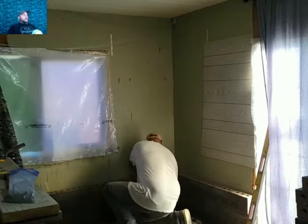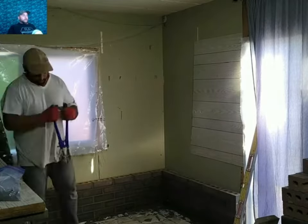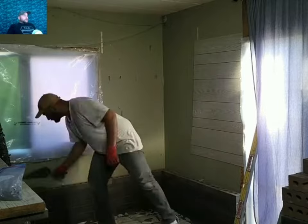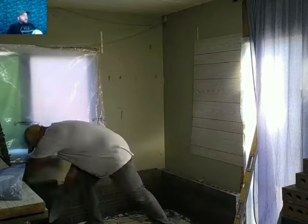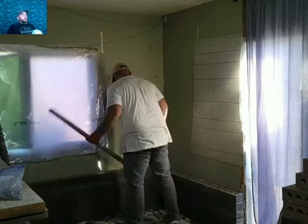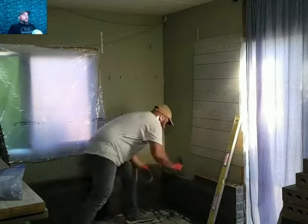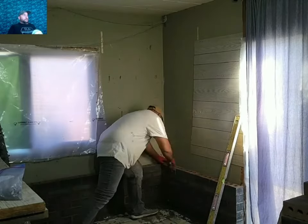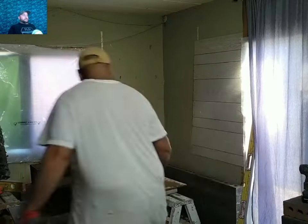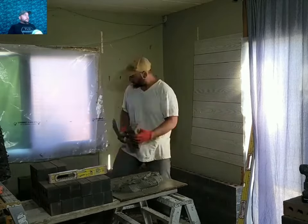One of the things you learn getting into bricklaying is that mortar is designed to be weaker — that's why lime is put into the mortar, for plasticity, malleability, and a bit of compressive flexibility. I've seen walls actually snake when blown over in the wind with very little damage to the joints. I'm putting quite a few fasteners in here. You can see a little bit of water damage but I tested those studs and it's fine. I also put poly over the windows as cheap insurance against dropping something.